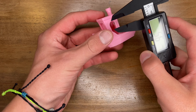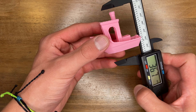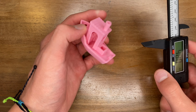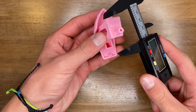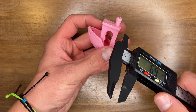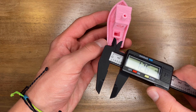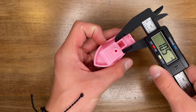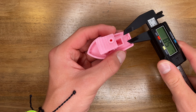Aside from all those tests, you can measure the actual dimensions of the printed boat with calipers to see how dimensionally accurate and dialed in your printer is. The Benchy website has all the dimensions listed, and a link will be in the description so you can compare your print to what it's supposed to be. The site has recommendations for your print settings, but they're obviously not mandatory and you can tinker around with them.